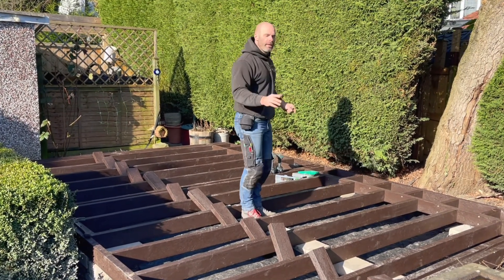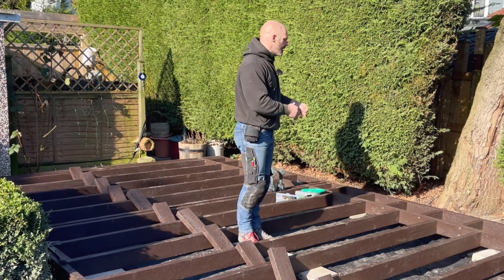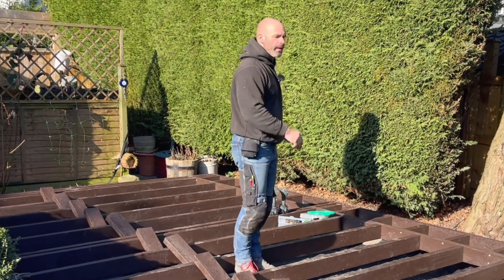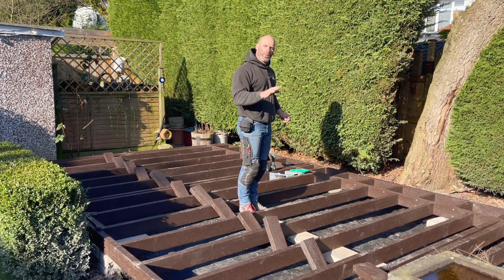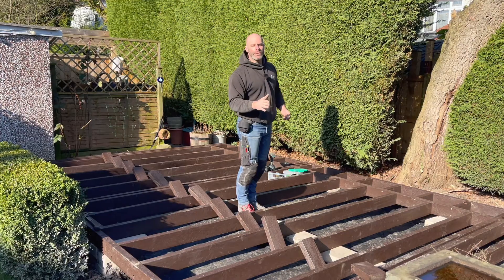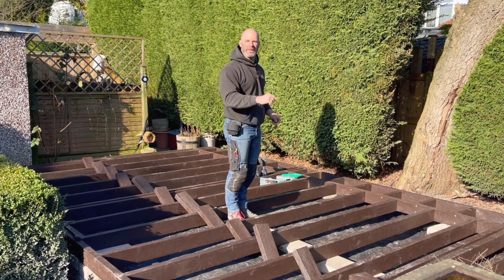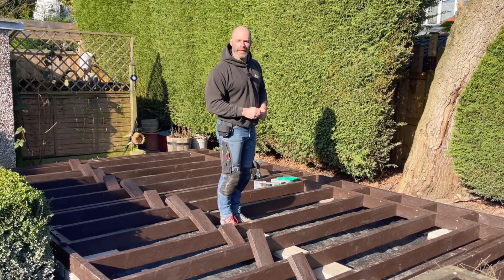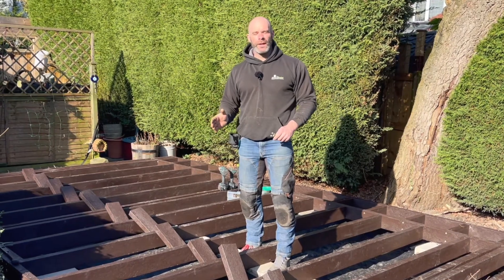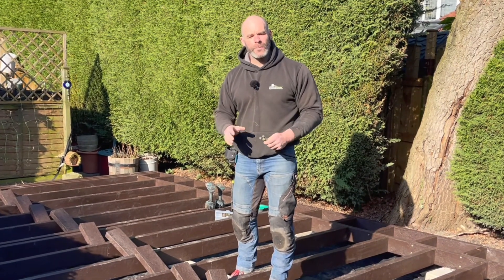The ladder that you can see at the back is because the overall dimensions of this deck were longer than the available length of this material — these plastic joists come at 3 metres, the deck is bigger, so we've extended our frame. If the joist pattern changes, that really doesn't matter because none of the fixings are seen, so you'll never know. Again, 400mm centres. The available span on these joists is a maximum of 1.5 metres, so all the concrete blocks we put in were to facilitate this scenario whereby there is no unsupported span greater than 1.5 metres, and it's worked very, very well. We've walked around on it quite a bit and it feels extremely rigid — that's kind of the aim of the game at this stage. We've also got a row of noggins to put in — that's a short piece of joist that sits in between the joists, firms everything up further, adds a bit of extra rigidity, and helps take any twist out of the joists. And that's pretty much it for the framework up to press.